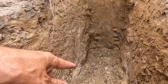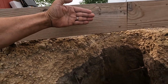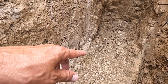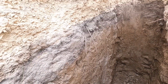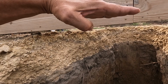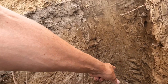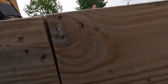So we're going to come up to, this is the outside of the building right here. It's going to be right about here. So we're going to put the curb stop right around here. And what I did is modify the curb stop so it's shallower. So that's going to be about 5 feet tall. It's going to come up to about here. That's the water shut off for the building. And then after the curb stop, it's going to go into here somewhere and then come up into the building.